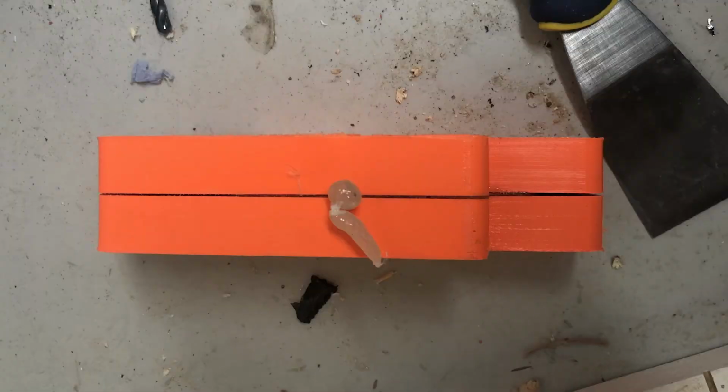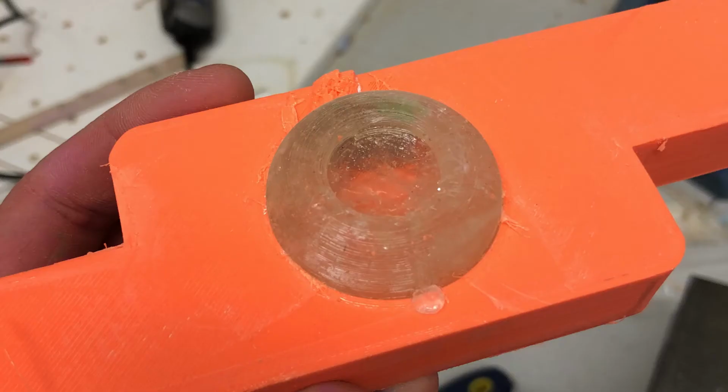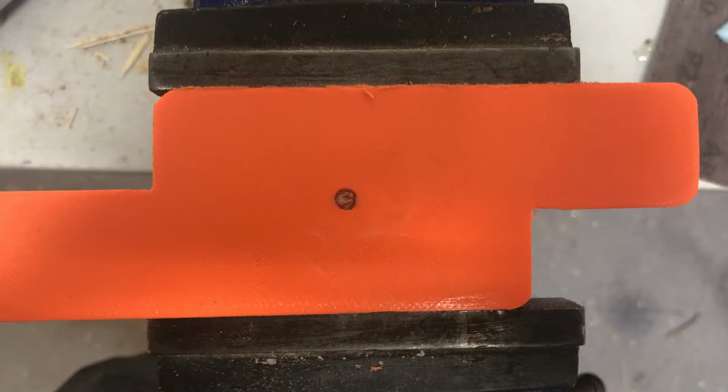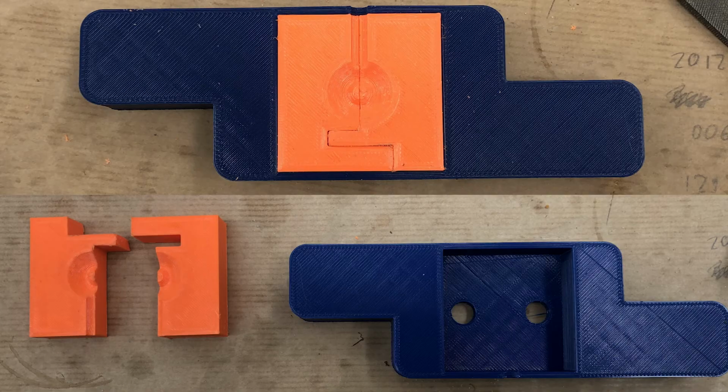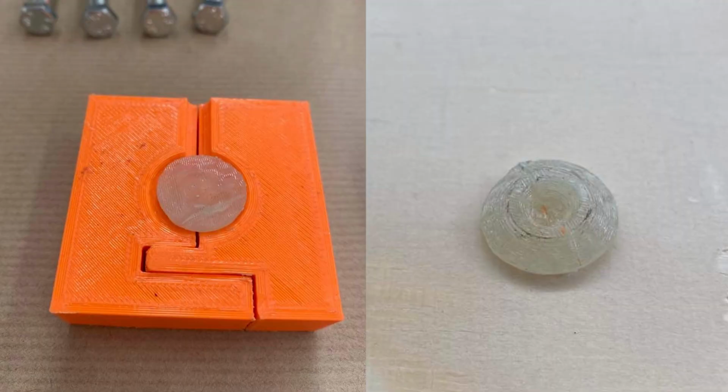However, I later concluded that the low melting point polymer polymorph pellets actually had adhesive properties that were essentially gluing the moulds together. I attempted my next iteration with PLA pellets and yielded much better results as I could now consistently separate the two halves of the mould after injecting. I still faced problems ejecting the part from the mould however, but determined this to be due to the mould design. I next redesigned the mould to have holes for extraction, but this ended up breaking the injected part as the PLA pellets produced a relatively brittle part material. Finally, I redesigned the moulds to have a split design in the hopes that the ejected part would simply fall out when they were pulled apart. This process produced my first successful injection.